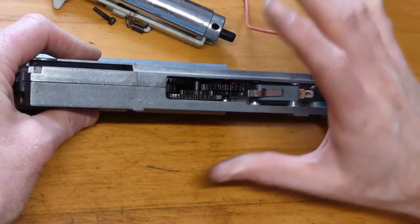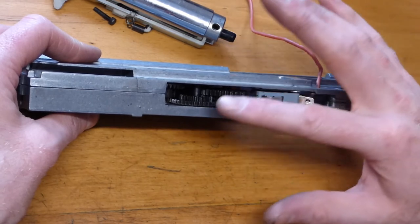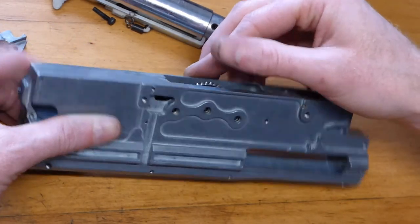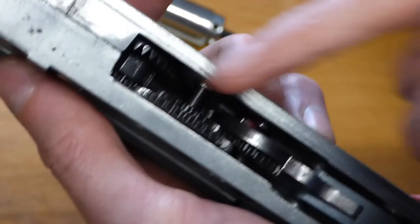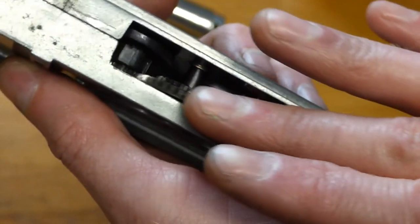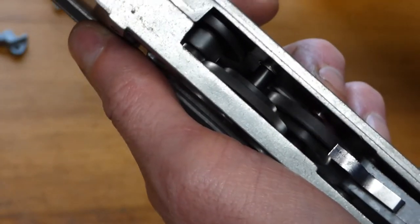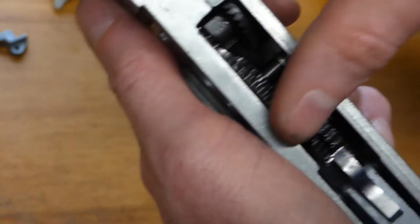Right, so I've just finished doing a bit of reshimming on the gears. There were a couple of things I did change over what I had done years ago — partly because I've got finer shims now, much smaller scale ones, which allowed me to make finer adjustments. Also, something I hadn't noticed years ago: I've now flared the bottom of these teeth on this gear. I've had the Dremel out and filed them up ever so slightly. The reason for it is the bushings don't sink completely into the gearbox shell, and the very bottom of those teeth was just catching, causing a little bit of resistance. But now they are really smooth with the new shimming. So final adjustments on the shims, some repositioning of everything, and flaring the bottom of that gear is really what I've done to make it better.